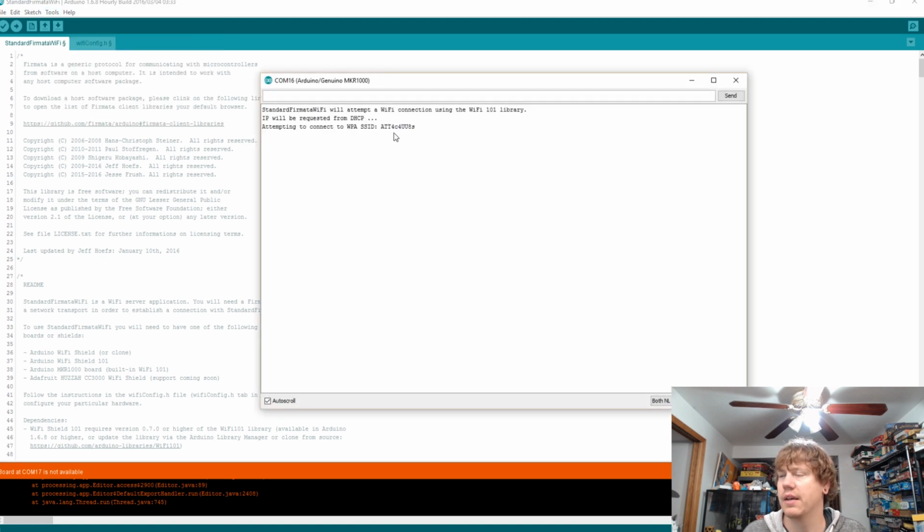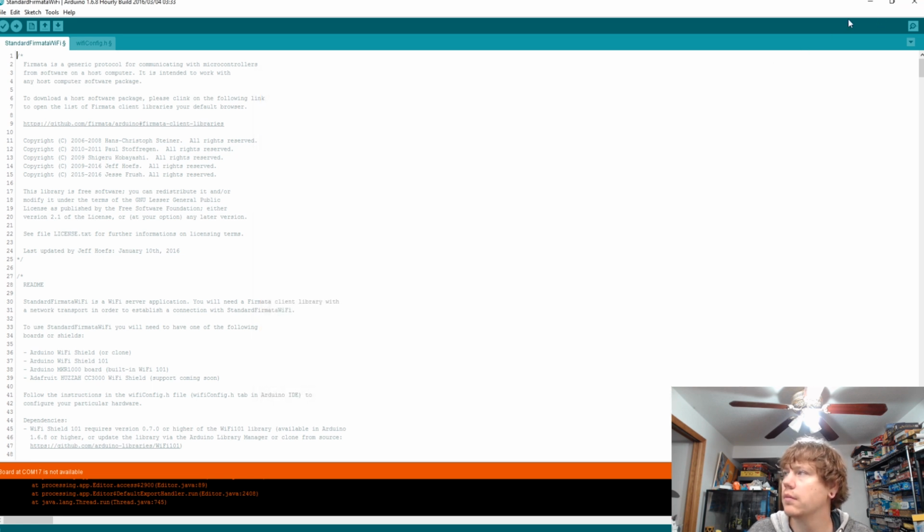Alright, so now it's connecting to my Wi-Fi. Alright, it connected. So here's our IP address, or at least the one that I have. So write down yours. It's 192.168.1.170 for me, because we're going to need that when we create the app for it. Also, since you have that address, you can use the Windows Remote Arduino app in the Microsoft Store. But I'd rather make my own app.